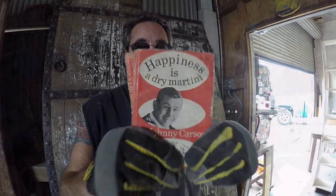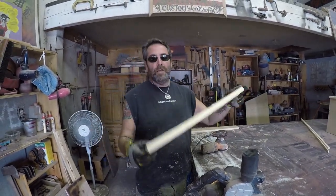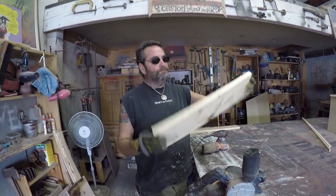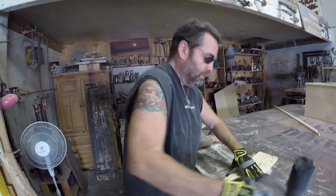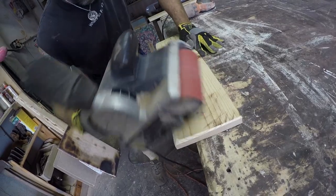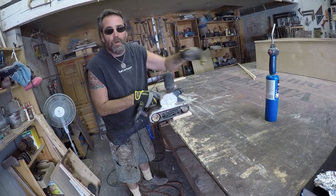On this week's episode we're going to mess around with a blowtorch and show you how to make pine — and other things — look old with a simple blowtorch. First thing we're going to do is quickly belt sand regular ponderosa pine, pumpkin pine, from Home Depot or your local lumberyard. Usually make tables out of these long planks. I'm going to dig in with the belt sander because then when we burn there's more texture.